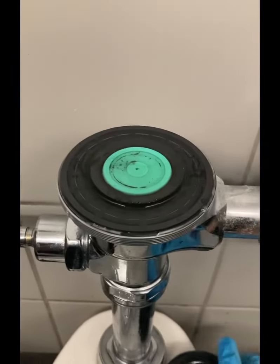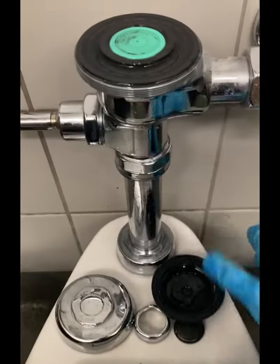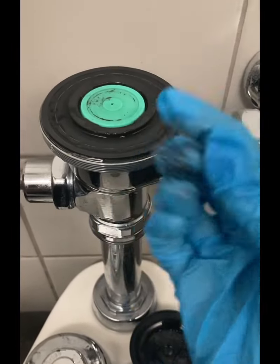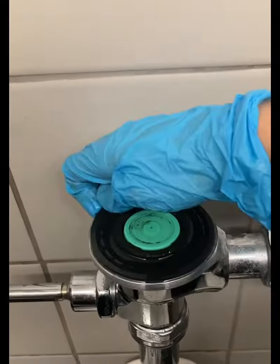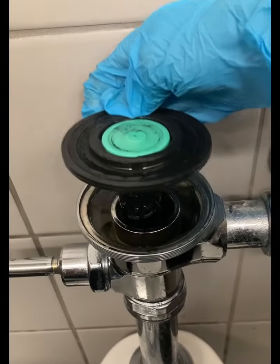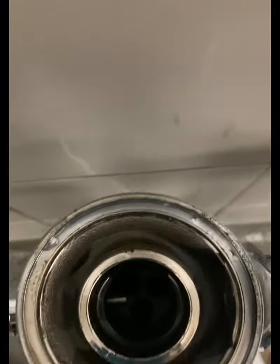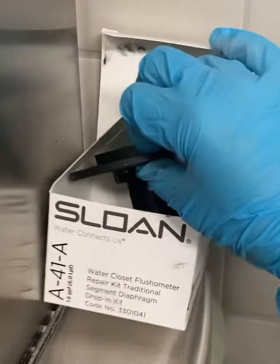There you can see the diaphragm within the flushometer. One of the things I look for to see if a diaphragm is faulty is that black gunk — you touch the diaphragm and you see black gunk, you know it's defective. Look at that black water running off. It's also a good idea to look in the body of the flushometer to make sure the diaphragm came out completely.